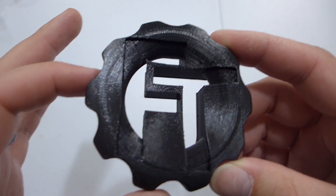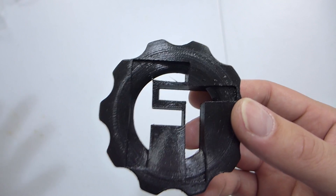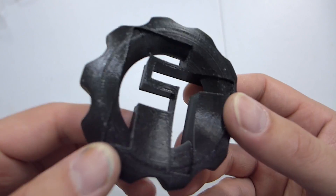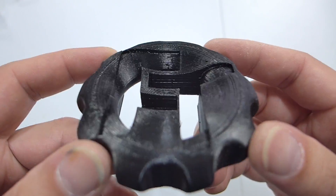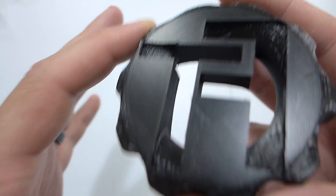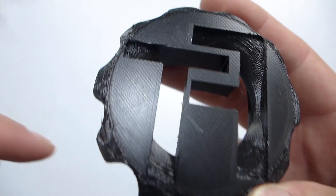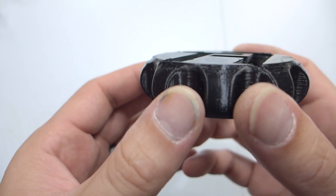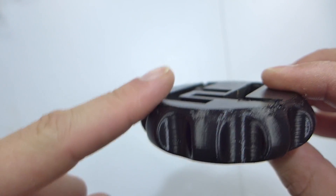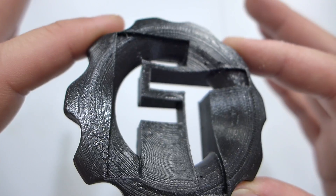Here we have the 3D Mars Black PLA. I reviewed the 3D Mars White PLA a long time ago and it printed out great — interestingly, they offer a 1.2-kilogram roll versus the normal 1-kilogram roll from other companies. Top layers are super shiny, all filled in great. This was printed on the Anycubic i3 Mega. It did pretty good over the supports, which came off fairly easily with Simplify 3D. First layers on the Ultra Base have a very nice look. Over the cogs it did a very good job — all rounded, no big flat problem areas. Very clean print, no stringing.